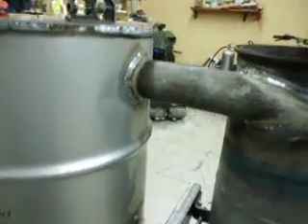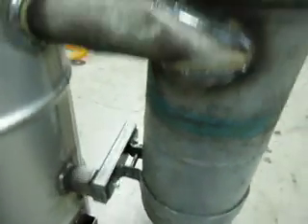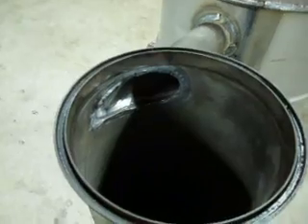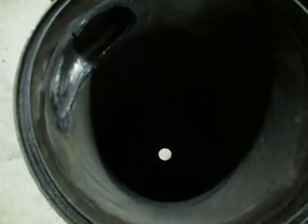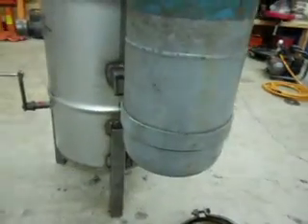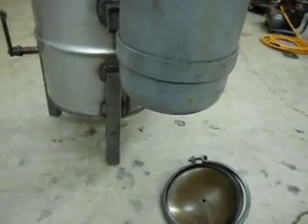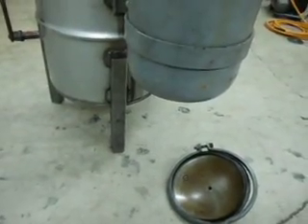It's a two inch pipe right there, and on the lower half I built a little supporting bracket to hold it. If we take a look down inside the cyclone, you can see where the two inch pipe snakes into the side to get the whirling action. Down on the bottom is just a one inch NPT thread, and I'll have a one inch close nipple hanging out the bottom with some sort of little plate — like a pickle jar or something — to easily empty out any ash or contaminants the cyclone filter collects.